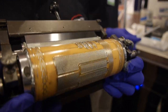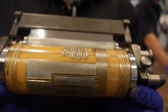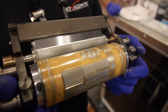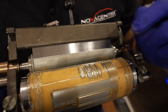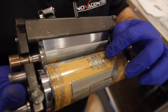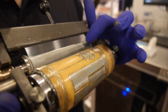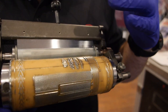So what are we looking at here? This is a Flexo QD proofing press — it's actually a flexographic press. Here you have a rubber stamping plate, actually a photopolymer rubber. What happens is it gets inked by the anilox with silver ink, and it transfers onto the high parts of the stamp, and then from there it transfers back onto the film. Using the anilox we can determine how much ink is applied to the film, and the Doctor Blade is there to make sure the anilox is metered properly.